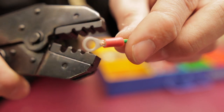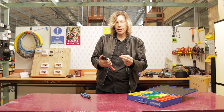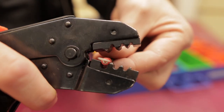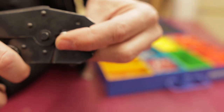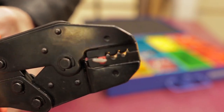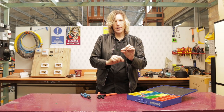With my ratchet crimpers I take the crimpers — you'll see there's a section that will squash down. Depending on the ratchet crimpers you're using, some have a hexagonal clamp, especially the larger ones; this one just has a point where it squashes in at the bottom. I need to make sure I'm lining it up correctly so it goes on underneath. I line it up for the camera and squash it down all the way. You can see it is nicely crimped down through the middle underneath, and that is done.